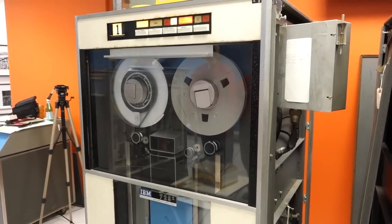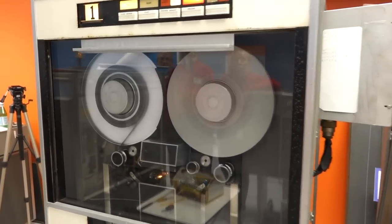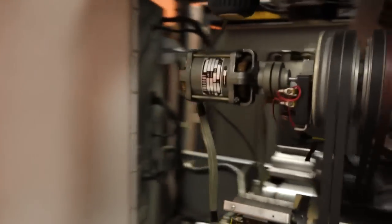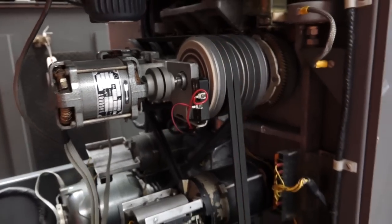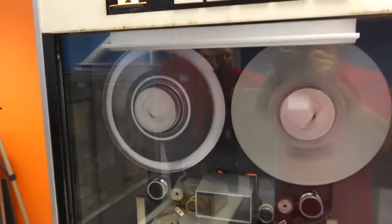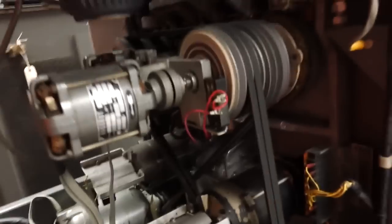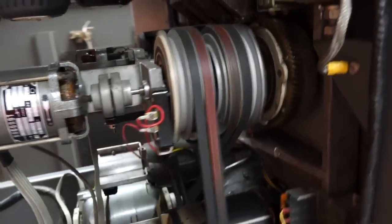We're going to try a high-speed rewind. So it just unloads the tape and does the high-speed rewind, and then zoop, off it goes. And there's a special motor to do that, which I think is this guy, for the high-speed rewind. And at one point it thinks it's full enough, it reloads the tape and continues the rewind in low speed using the clutches and the regular motor, because it's using that one and it's clutching in and out thanks to the brushes.